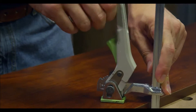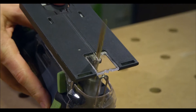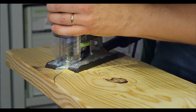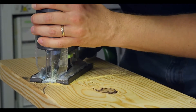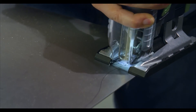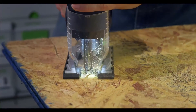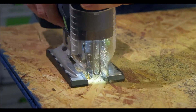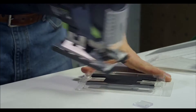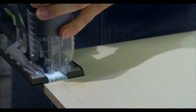The Carvex can be adapted to virtually any material or application. The standard base is great for a lot of different surfaces. The hard fiber base insert is a phenolic resin base that glides very easily on virtually any wood or wood-like materials. The steel base insert is great for work on metallic surfaces, protecting the standard base insert from scratching while giving you a perfect mating surface. The dimple base insert reduces surface area so it glides easily over rough surfaces like OSB or rough-cut lumber. The stick-fix base insert uses a replaceable felt element with a hook-and-loop system, very easy to peel on and off — the felt helps protect pre-finished plywood, acrylic, or soft plastic from scratching.